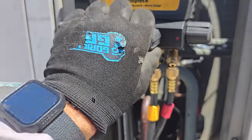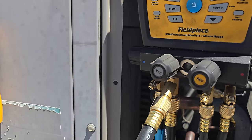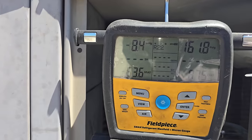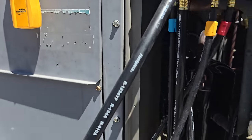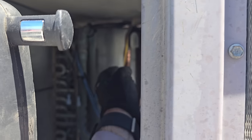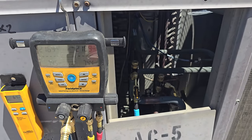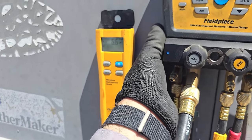We are ready to charge this bad boy up. We've already purged it — 14.2 pounds is what we're looking for. We're going to open up the high side and dump it in on the high side; it should be coming back on the low side, which indicates the metering device is allowing refrigerant to pass through. We're looking for 14.2 pounds and we're at about one pound right now, so we're just going to let that run for a little bit. We're going to turn this guy on because it won't take any more than six pounds — go ahead and fire it up. It's running in the right direction. We've got it jumped out and we're just going to add gas on the low side to get up to the total refrigerant charge.